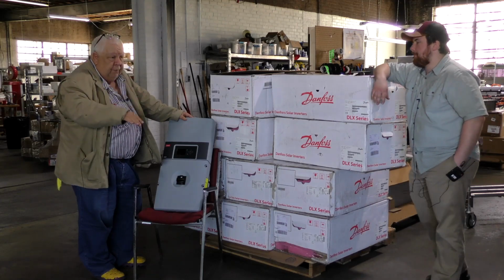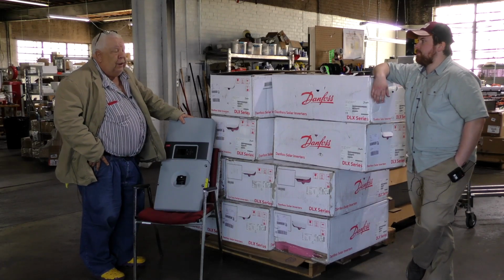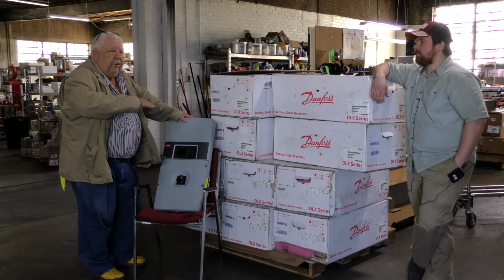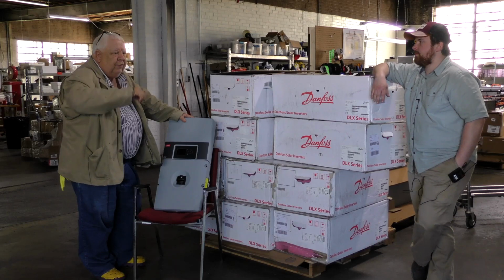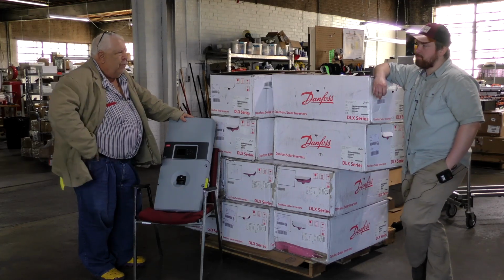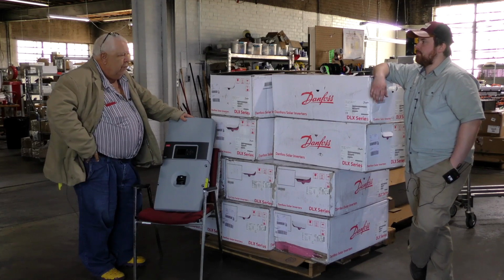And as the requirement went down, then you would switch off your grid-tied inverter and recharge your battery slowly so as not to cause a peak. And that would be a peak shave device where the utility would see the power usage going up, and at a threshold just below your threshold for the building, it just gets chopped off for the time you need more power, and then it falls away after that.